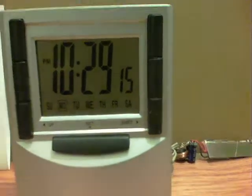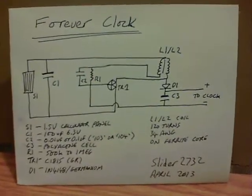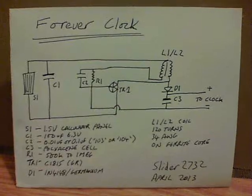After about a week of testing, it looks like this thing will just keep on going. I've got it balanced here on a piece of tape just to show there's no shenanigans on the back — it just goes directly to the leads, to the connections. Here's the circuit for it, and it uses a C1815, the GR variety of that transistor.